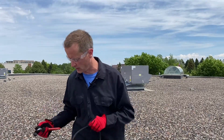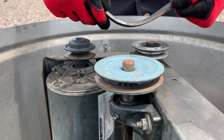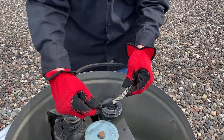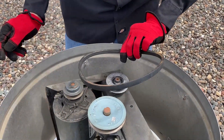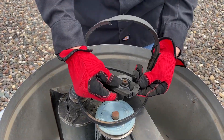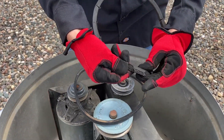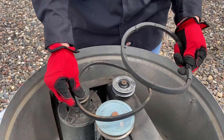The next thing I want to do while looking at the belt is ascertain the health of the belt. That's a pretty good-looking belt — no cracks, no chips, no frays, no threads coming out of the belt; it's a solid black color. I like it. I have here its distant cousin — a pretty gnarly belt. See how it's chunked out? There are pieces missing, there's fraying. This isn't a good belt. These two don't talk to each other at the family reunions.